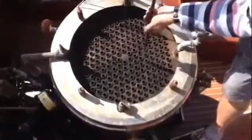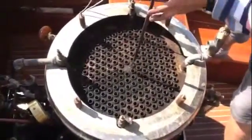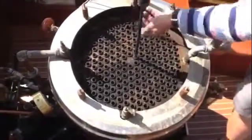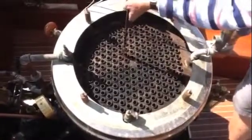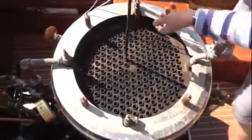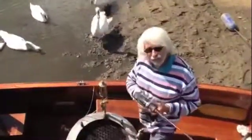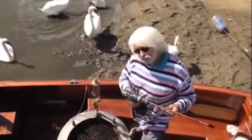Like this. The handle is long enough to go to the bottom of the tube — down slowly and up fast. I can do this boiler, which has got 209 tubes, in about 20 minutes. Very quick.